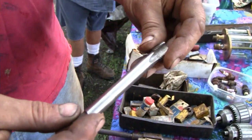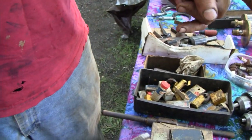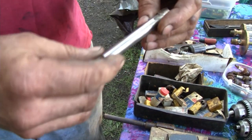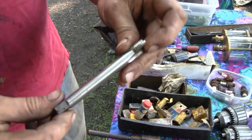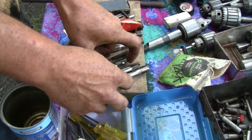We got another one here. This is a 5/8 coarse thread — this is a little extended tap, you could call them short pulley taps. Some pulley taps might come a little bit longer. This is for getting down alongside of things. That's a pretty much a plug tap style but short, probably a production type machine tap. That's another thing I've never come across.